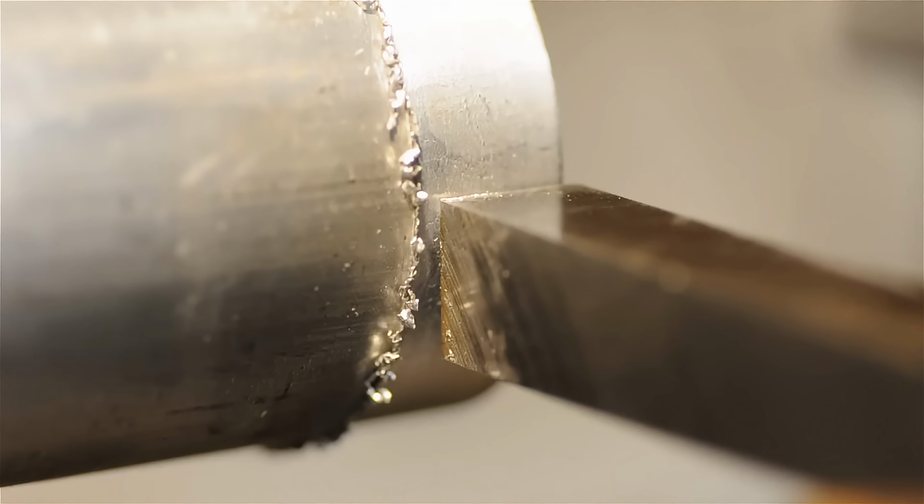The other place this tool is running is sort of immediately underneath that leading edge, sort of the side of the tool facing the chuck. Again, it's leaving 2 surfaces behind as it's cutting, so there's 2 faces, in our case, that it's potentially rubbing on. And in fact, here you can even see some of that aluminum has transferred onto the high-speed steel. So just like we were looking at the top, we'll want to grind away some material here so we're providing some clearance, so it's not rubbing there.